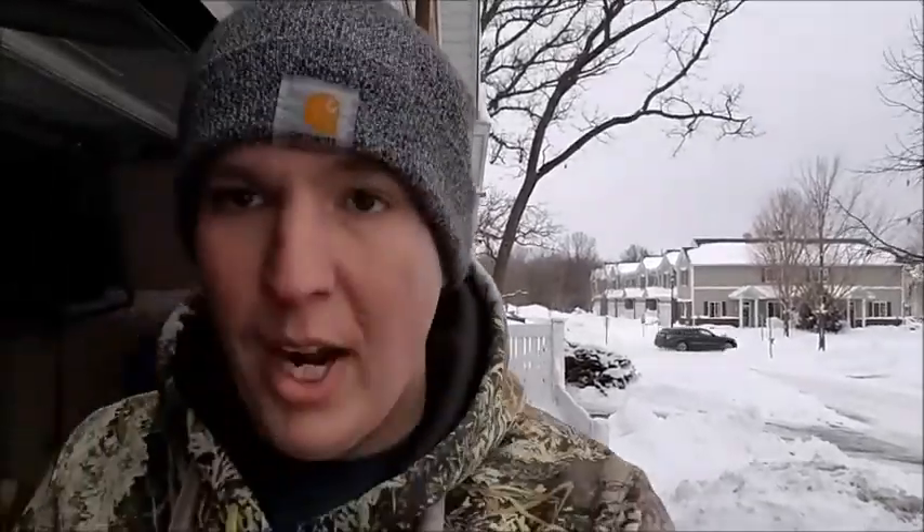It's not the prettiest thing in the world, but for somebody on a budget it works great. You can even do the bucket-with-brake-drum method like Chandler Dickinson's bucket forge. Any kind of blower works — hair dryer, bathroom vent fan, anything. So that's eighteen bucks worth of materials plus six bucks for charcoal — under twenty-five dollars and you have yourself a nice little starter forge. Leave any questions in the comments below. Have a good day, like and subscribe!